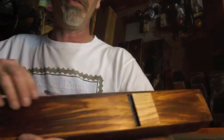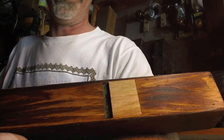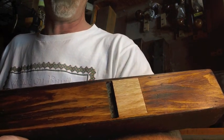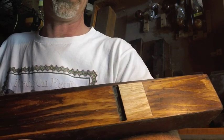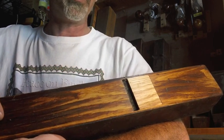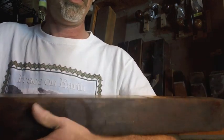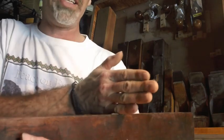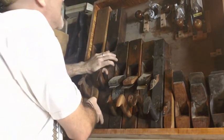As you can tell I have worked on the bottom to get it flat. I use a large piece of glass with some rolled sandpaper a little bit longer than the length of the plane, and I make chalk lines to see where my high and low spots are. I check for consistency with a good straight edge — you can set it flat and use winding sticks on it as well — but you're reaching for absolute flatness on these planes.